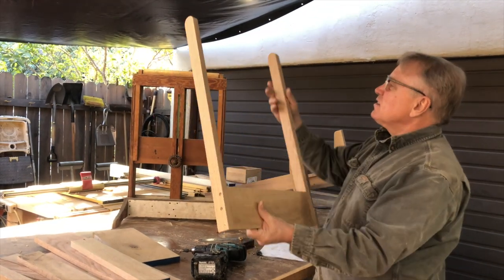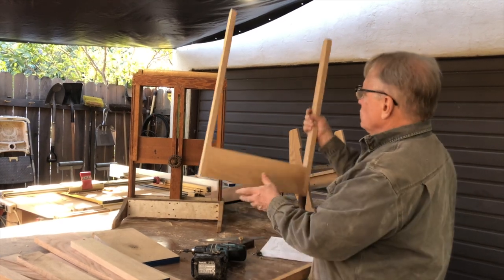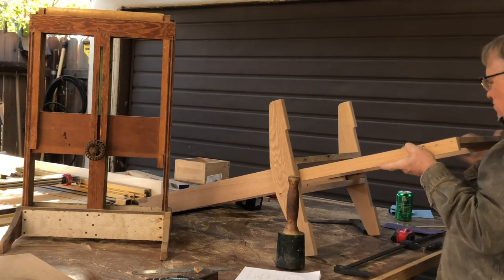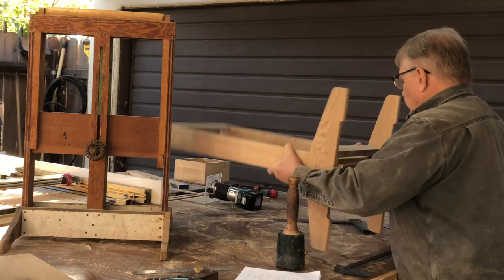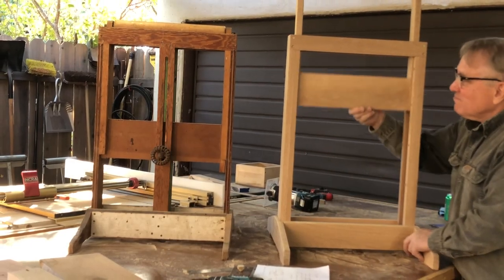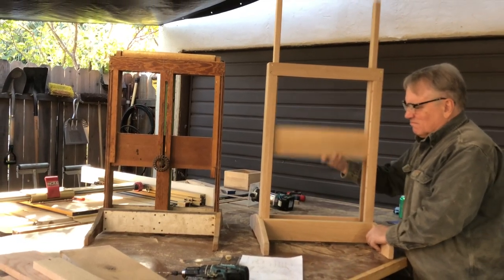The spreader that goes between those two side sliders is one more place where we can compromise the functionality of the sliding piece - wide enough that it doesn't pull those two pieces in, and narrow enough that it doesn't push those two pieces against the sides so that it's too tight to slide easily. Once we determine that dimension and cut it very squarely, we can screw those side sliders onto this stretcher. All the joints that I use screws to attach are pre-drilled and countersunk - pre-drilled because I'm working very close to the ends of a lot of these boards and I want to avoid any splitting. Pre-drilling is very important. Don't overlook it. And it easily moves up and down, in and out, without too much slop. So far so good.